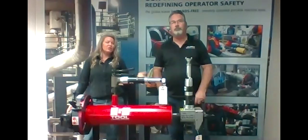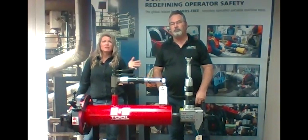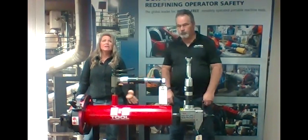So the reason why you would want to do the second blade would be because of heavy wall or hard material. And again, like the boiler guns, this machine can do counter bores, compound bevels, reverse bevels, shortening of tubes, and J preps.